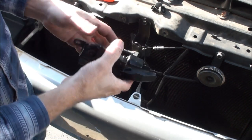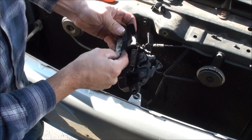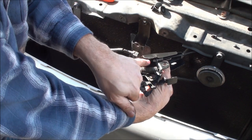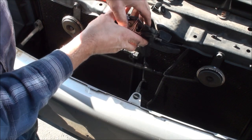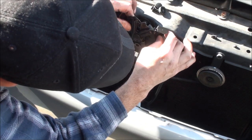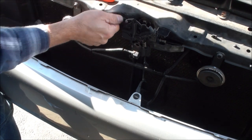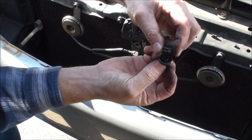It goes from here over to here. I've got the main spring back in — it goes in with the tiny spring towards us. The first thing is to get the cable in; there's a little notch right here so you set this little ball right in there, and the cable sits down in here like so. There are three bolts — one here, one here, one here. Lift this up, this piece goes behind the metal bracket, and get the bolts started. The center bolt has a little cap on it, so you need to pop the cap to access the bolt. These are all 10 millimeter.